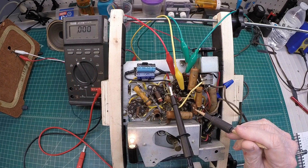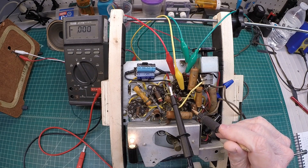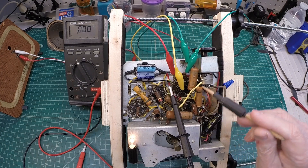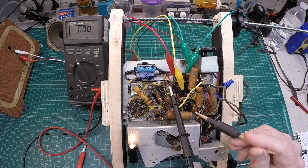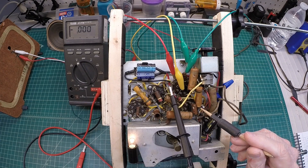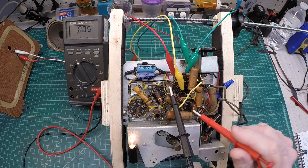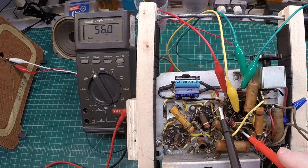One of the things I mentioned in the previous video is that the plate voltage of the 12SQ7 was not impacted. I had 56 volts DC on the plate before jumping in the parallel resistors to correct the resistors that drifted high. You saw where R15 was impacting the B+ voltage over to the 90 volt side, and I read 56 volts here before — and you can see I'm still reading around 56 volts.